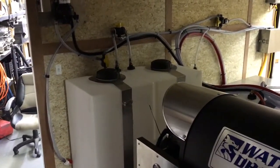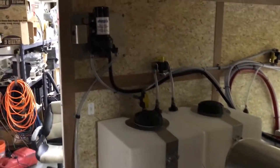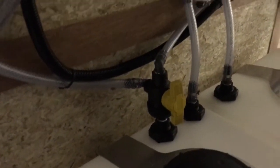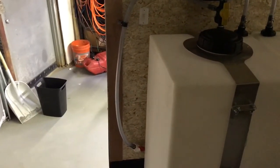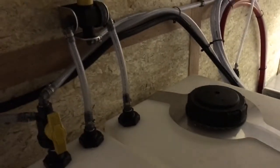We have two tanks available for both bleach and Agent Blue solution. We have a transfer pump on here that allows him to draw from either bleach or water, controlled by this ball valve right here — coming either directly out of the tank or from the water tank, which is a 200-gallon water tank over here. So he has the ability to select between water or bleach, run it through his transfer pump, and put it into a bucket or whatever he wants.